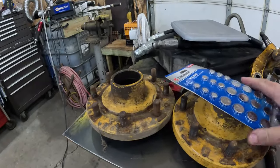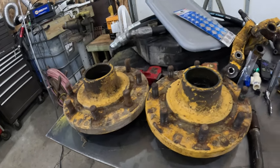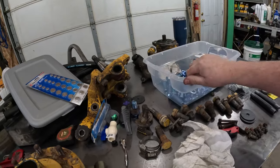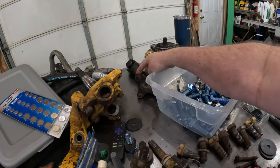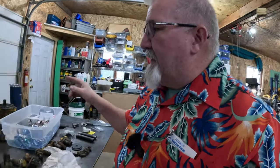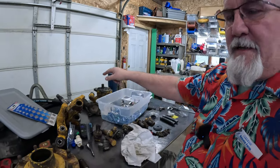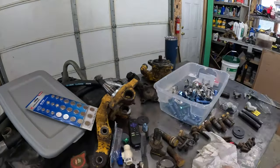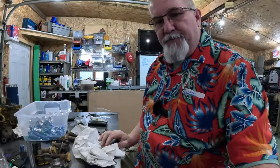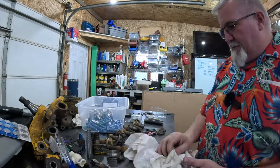It takes a little bit to get all your parts together. Like I said, I've got wheel bearings coming. I got bushings coming. I got a new pump coming, got a brand new drive shaft coming. Now, is this drive shaft rebuildable? You betcha. Will I rebuild it? Most likely. But I can put a brand new one in there. I can now play around with this and knock the U-joints out. Those U-joints are smaller than your average U-joint that's on a vehicle. They're a little bit tighter. But so we're one step closer.